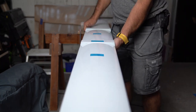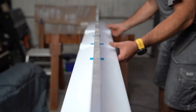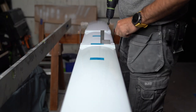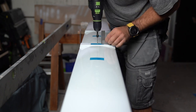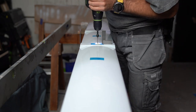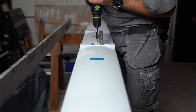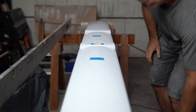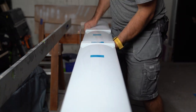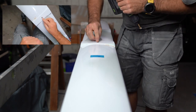As you can see, there's a brand new plank with nothing on the bottom. Before drilling, I want to make sure that the plank sits leveled and supports are leveled as well — that makes the drilling operation easier. I start drilling with a three millimeter drill, and a square may be very helpful here. Before I go top-down with the final eight millimeter bit, I start with a light touch from the bottom to avoid paint splintering. Keep in mind that I make a 20 millimeter diameter hole in the wooden core before infusion, meaning I'm drilling through solid resin and no bushing will be needed.